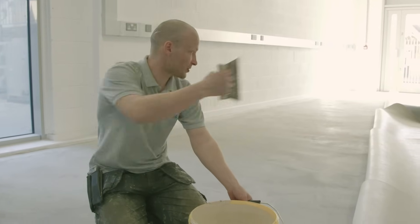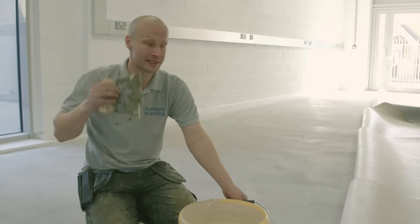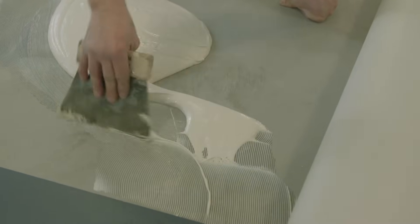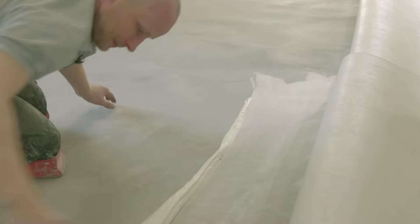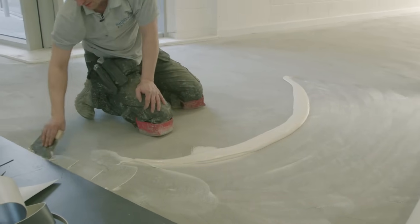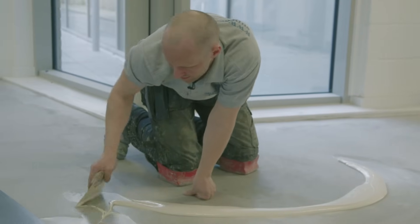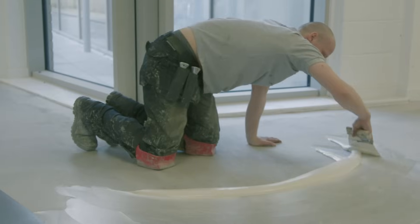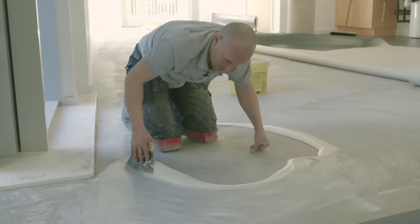So once your floor is ready to go, you've pulled back half the vinyl so now you can start gluing out. I use an A2 trowel because it doesn't leave any glued trail lines underneath. Use the approved glue available on the Colour Flooring website — this is a water-based acrylic glue. Always carefully read the instructions on the tub before you begin. When you're gluing out, you'd like to do it as a big smooth sweep so you're spreading it evenly over the whole floor, and you just keep working it back to yourself.